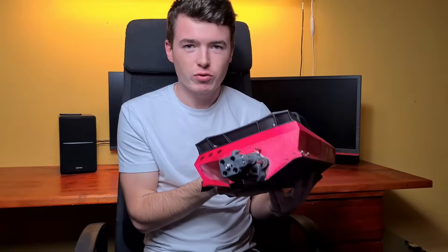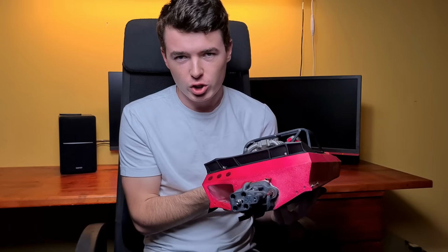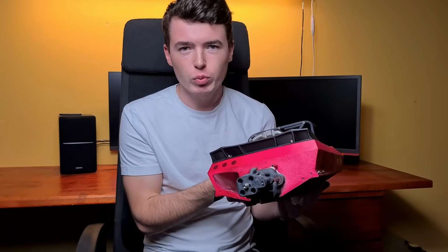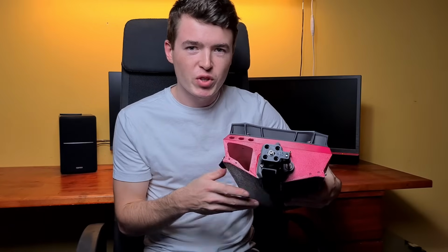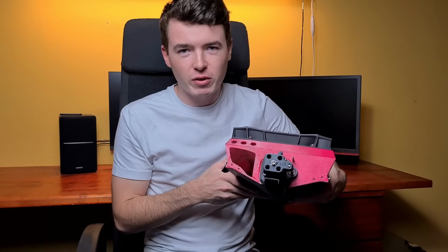The reliability of the self-righting depends a little bit on which battery and which electronics you choose, because that changes the CG of the hull, but generally it should be possible to make the Ragnarok self-right. Then there is the other version which doesn't have the flat chamber, and that version has all other advantages. Apart from that, it doesn't self-right. So if your boat flips over in the middle of the lake, you will have to find different ways to get it.